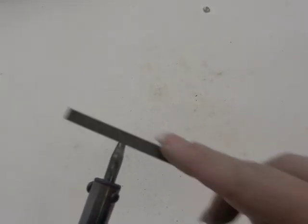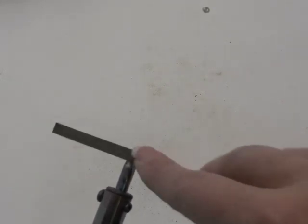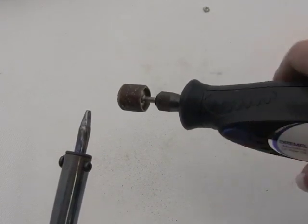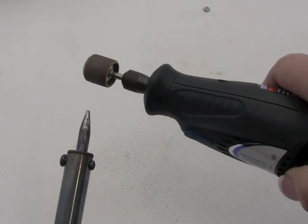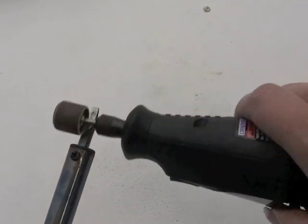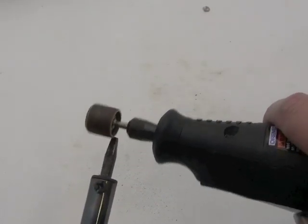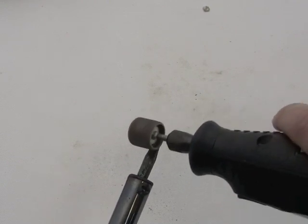I'm going to keep sanding all around this piece. I don't really need to go up in the area close to the barrel - really it's just up at the tip where I'm going to be soldering. Another option, if you have a really bad tip, is to use a Dremel-type rotary tool with a sanding attachment. Be careful with this because you can get really aggressive too fast. You can take the rotary tool on low speed and sand off and clean off the black that way as well.